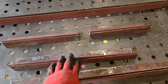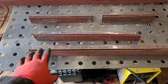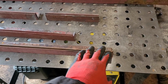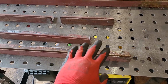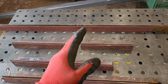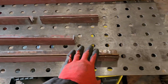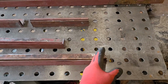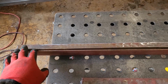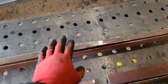These are for the actual seat frame rails, and this is the back one. This is the one that's going to be on the floor. I made this 6 extra inches long because I wanted it to be a little bit stable. Like a couch leans, right? So I didn't want somebody to get into the seat and then all of a sudden feel like they're gonna fall back. So this is just basically a little extra spacer, so that way it doesn't give you the feeling of falling. And then these are the frame on the floor across the entire seat. And this is what's gonna hold and brace the bottom part on the floor.